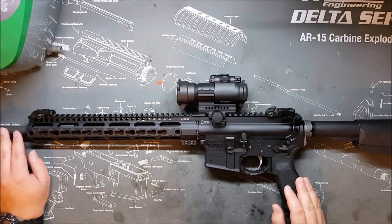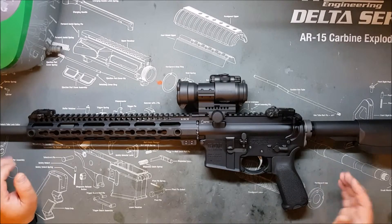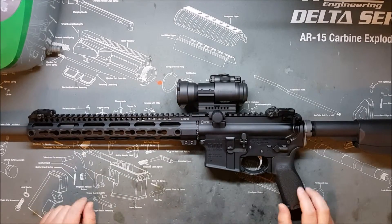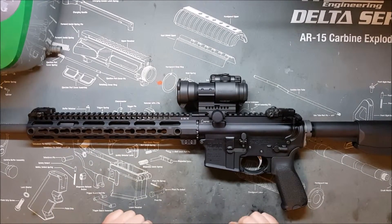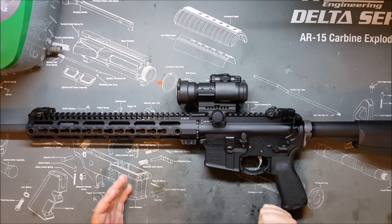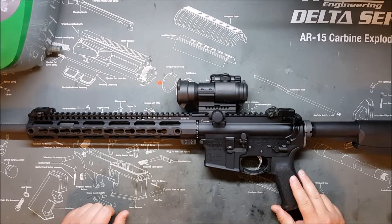You can also see stainless steels used for barrels. Stainless steel is usually used in barrels made for precision shooting. It's a little easier to work with than carbon steels, so it's easier to make a very smooth bore, meaning it'll be more accurate. There are many different types of stainless steels with different hardness levels and toughness properties, and not all stainless steel barrels are created equal. A cheaply made stainless steel barrel will not shoot well just because it's stainless.